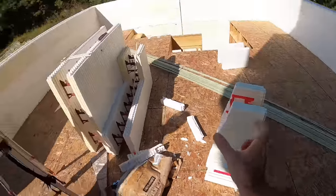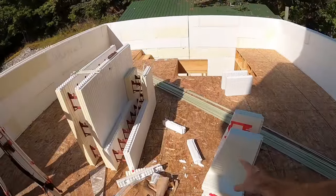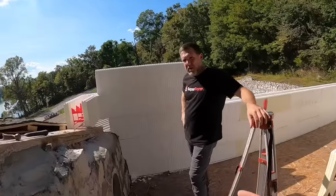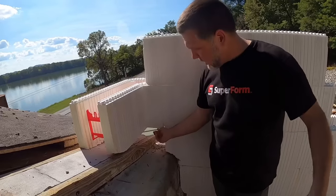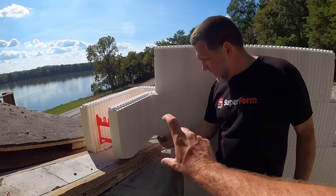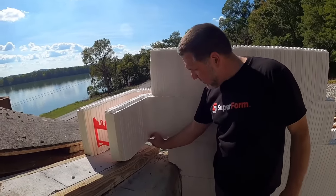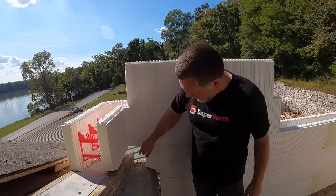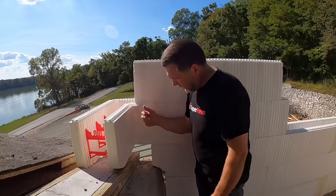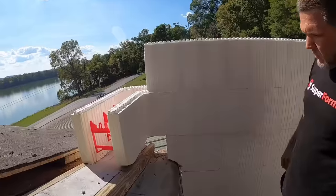But what you're saying is, since I already butchered a corner trying to determine if I had enough height to start with a really short corner down in the bottom, this corner's essentially useless, but we're going to make use of it. And what you're saying is we're going to just use straight styrofoam. Yep, we're going to cut out a foam wedge, but it's going to be a corner wedge. And it'll have the stud block still in it, and we'll still have the web in it, that we're just showing you that you can fasten to. We'll have that part in it, but it will not connect to the other side. So that will fill that out, and that will give us thermal protection for thermal transfer through the wall. And it will also eliminate that shoulder problem of concrete coming in and lifting that wall up.